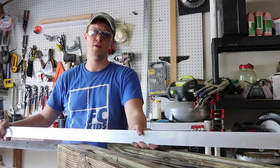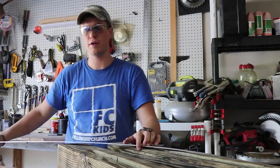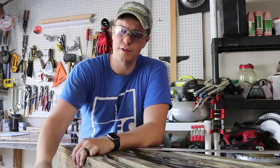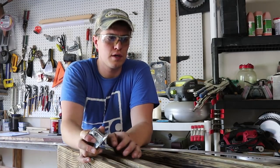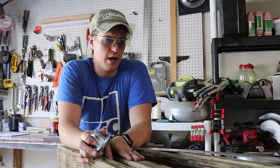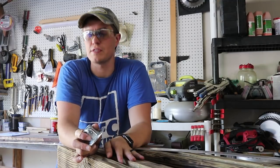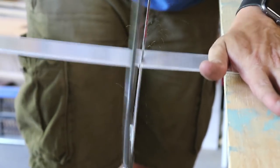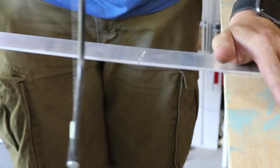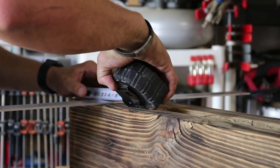The hardware includes the aluminum flat bar I purchased, which is going to be the metal banding going around the beams, and the pipe fittings that are going to go in between the two beams and turn the whole chandelier into a big square instead of just a straight piece. The length of each piece of aluminum strap was equal to about the circumference of each beam minus about one inch — I'll explain why minus the one inch later.